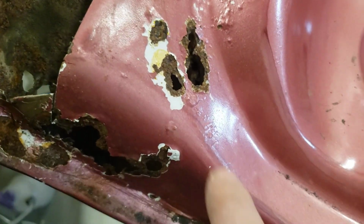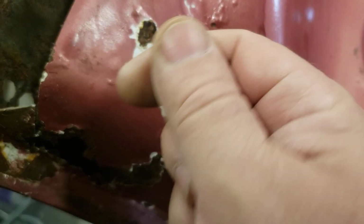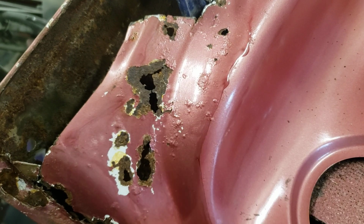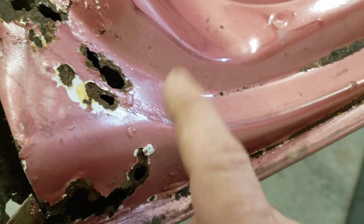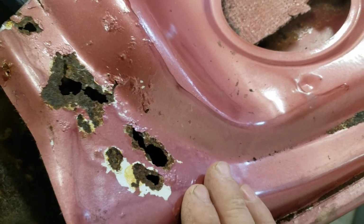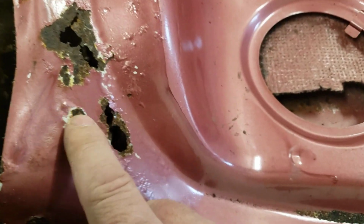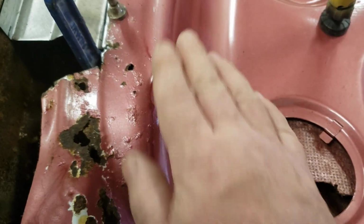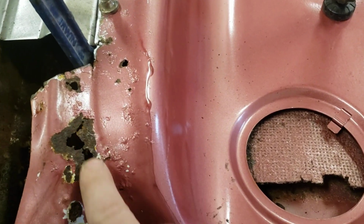Once we weld the top and bottom, we can put a little bit of a round in it and push it down against this plate. That'll be flat and templated already. And when we remove this piece, we'll make sure we don't wreck it. We'll basically surgically take it out. And the hard part is this piece is also bad, but this is the one we want on the same plane, so we'll make sure we keep that. We'll concentrate on that first, and later we can cut a chunk of this out and put whatever. And if it's a little off, as long as it looks smooth, this is where the rubber goes.